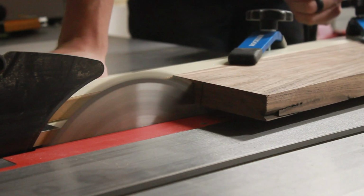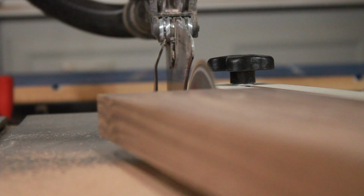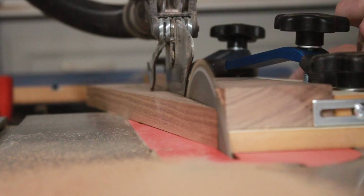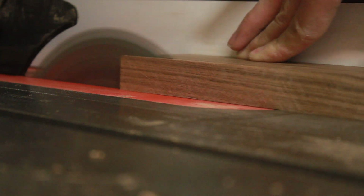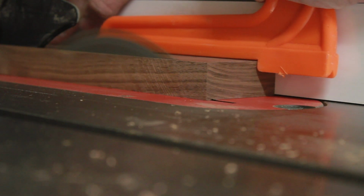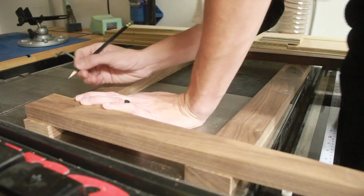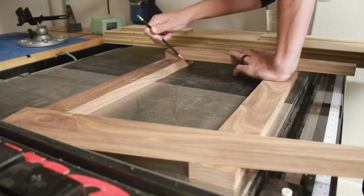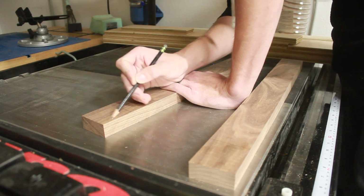Now as I'm cutting these tapers, I want to talk about just a general woodworking concept, and that's accuracy. My goal here is to go from 2 inches to 1 inch, but those numbers are really arbitrary. What I want is 4 consistent legs. And this also goes when you're cutting things to length. If you're an 1/8 or 1/16 of an inch short on your cut every time, that's okay. You just want to be sure that you're that same amount long or short on your cut every time. In my opinion, consistency on cuts is more important than the accuracy of the cut in woodworking.